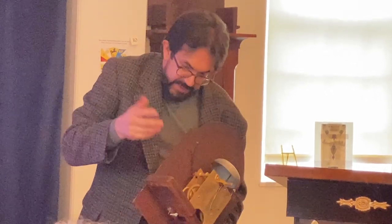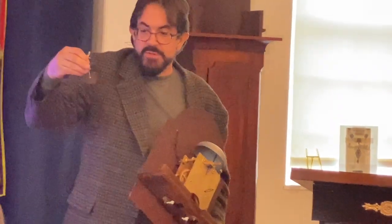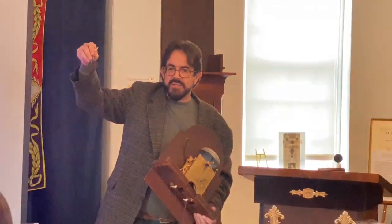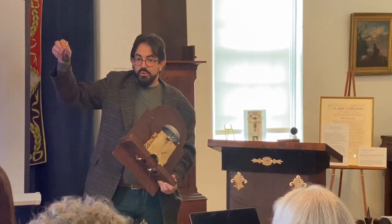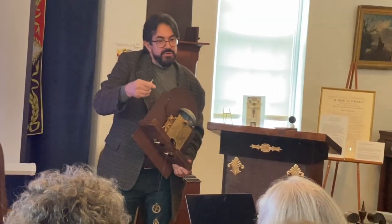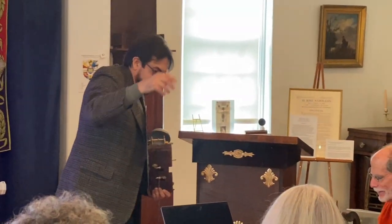So it doesn't work. And the last guy too, I don't even know who he is, and don't want to know who he is, but he had put these on there, or they were on there, and they should have been removed. These are for the Seth Thomas mantel clock. These are wooden pulleys. With this kind of weight on this clock, 14 to 18 pound weights each, it's worn a heavy groove in here. So imagine that heavy groove of the cable worn in here eventually. Say the beginning was working really well, but then it started to wear the groove. Now, as it's getting caught in the groove, it's creating additional friction. And that's another reason the clock wasn't running properly. So, these are for Steve. He can put these on his mirror of his Porsche.